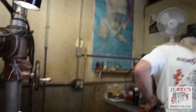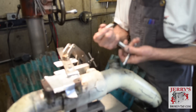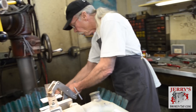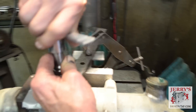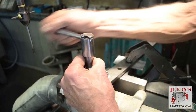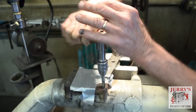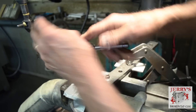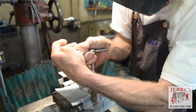At this point, this is a three-eighths diameter hole and all the threads are gone. We'll get a nice new three-eighths tap and put a little bit of cutting oil on it. You have to chase the threads when we're done - always, especially with material like this, it's cast iron. The bolt had rusted in, so you've got a lot of rust inside that hole - it's pretty difficult to tap. That's simply because there was so much rust and corrosion inside that hole. The resistance and crackling you hear is just getting rid of all that rust and material that has developed inside that hole over the years.